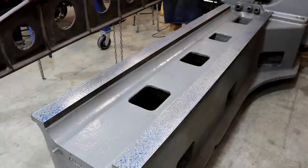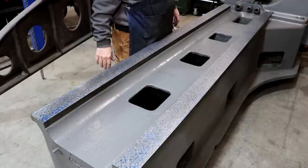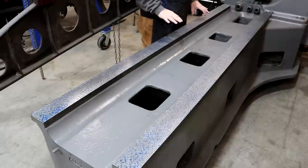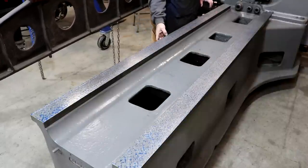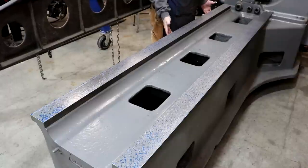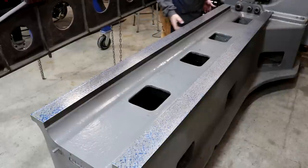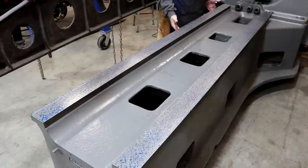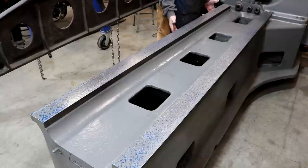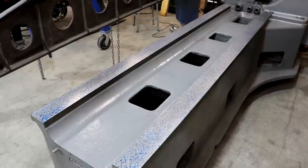The results of the long straight edge: I think we got good contact. I'm very happy with that — it almost looks better than across all the ways. I think we're good in pretty much both directions. There is one more measurement I want to make: I want to measure the thickness of this from end to end as a comparison, to make sure we're working off the original surface. As long as we have fairly close measurements from end to end on both sides, that should mean we're back to the original plane this thing was machined in.